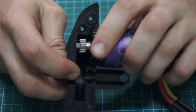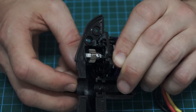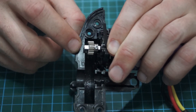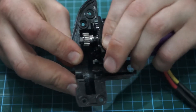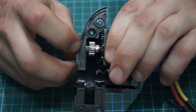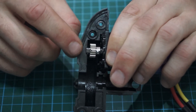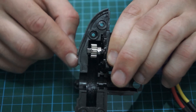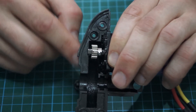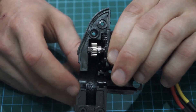So what's happening, guys — the shaft of the motor is about a mil and a half too big, and it's rubbing against the casing. So what I'm going to have to do is use my Dremel and put a little bit of relief here — hopefully there's enough plastic behind here. If I do go through I'll have to put a bit of hot glue there just to seal it up, because I don't really want any grime getting into this case. Alright, let me get my Dremel out and do that.